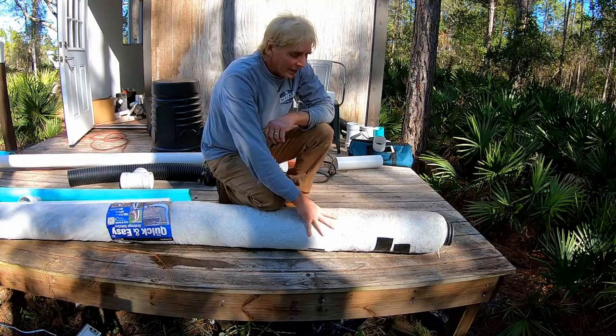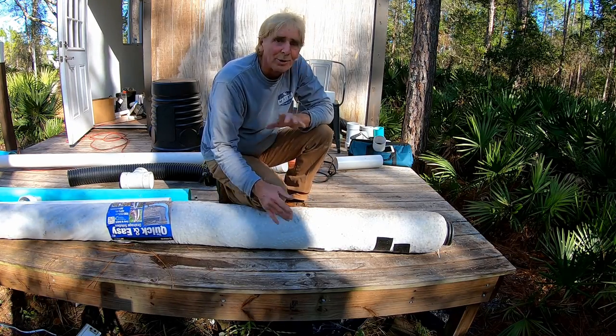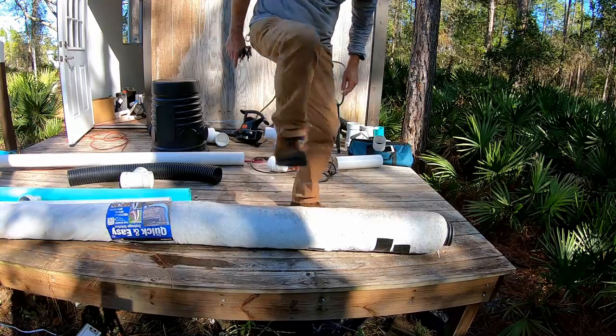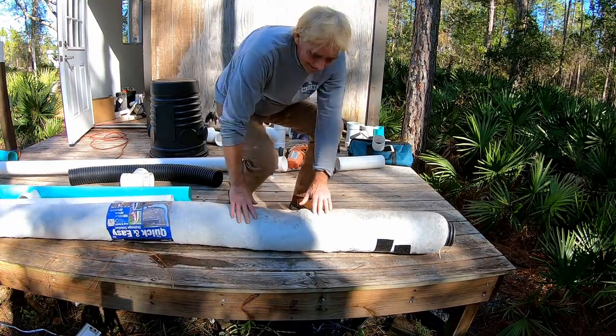All the pipe — HDPE, that's high-density polyethylene — makes no difference what kind it is; they're all the same. You can stomp on them and prove it to yourself. If you go to Menards, if you're up north, take a piece of pipe out, stomp on it, see what it does. But let me show you one more stomp test that people have been curious about: the quick and easy drain. Let me show you how strong that stuff is — here's a piece of the easy flow, an old piece that's been laying out in the yard for a long time.